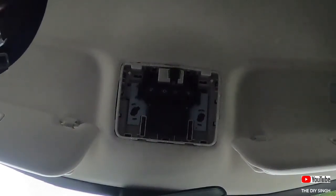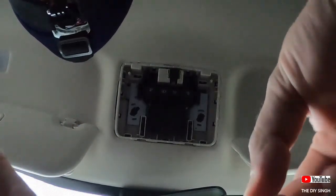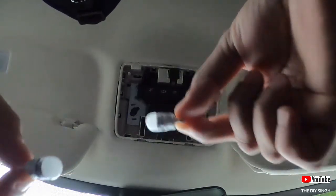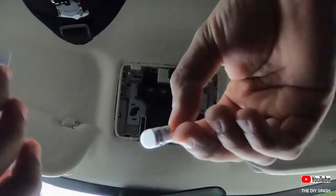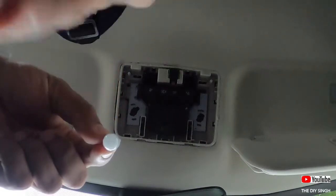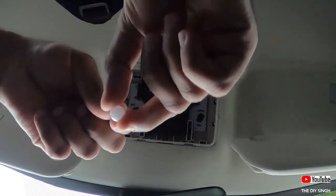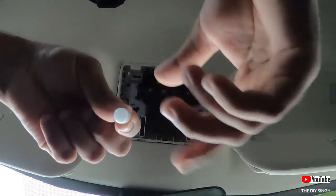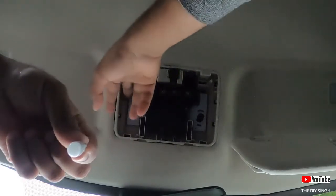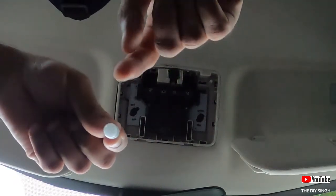Covers are out now and we are going to install the lamps. Why I have selected these type of lamps: there are multi-directional lamps also available in the market, but these lamps are used every time the door is opened or the car is unlocked. The installation direction has the tip of the lamp facing towards the floor of the car. If I use multi-directional LED lamps, the light will be wasted inside the box because the closure of the light doesn't have any reflector at the base.